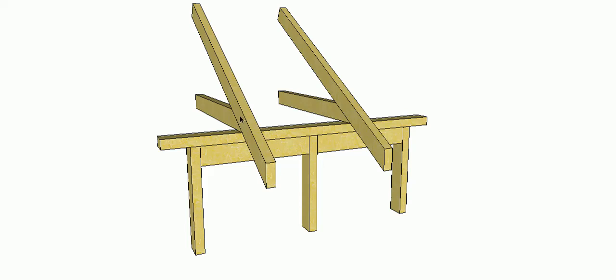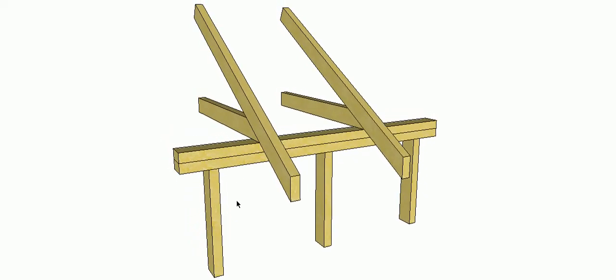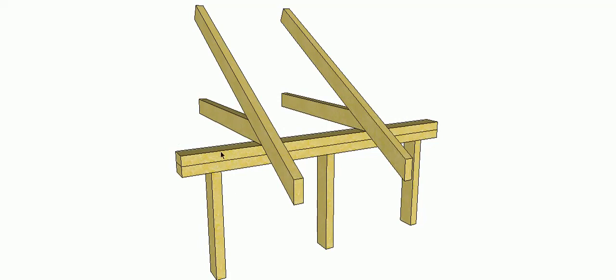So the other most common alternative nowadays is to use a double top plate — that's one of the reasons why we use a double top plate. By doubling up our top plate, or by just using a top plate that's 70mm thick instead of 35mm, that gives us the extra support we need to transfer that load. And another common reason is to allow us to randomly load our top plate.